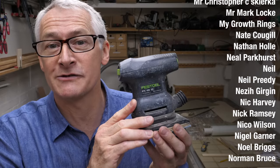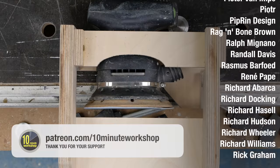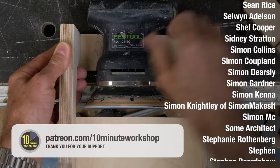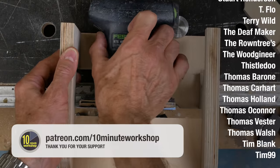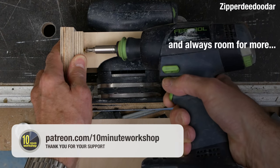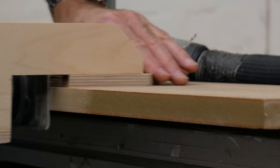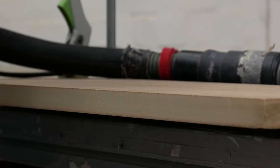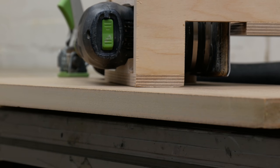There is one other reason actually: I don't use my ETS 125 for edges. Don't get me wrong, it's a great little sander, but I prefer my orbital sander — the RTS 400 — for edges. It's just as small and light as the 125, but I think the dust collection is better on an orbital than a random orbital when working on relatively thin edges. I'll definitely be making a version of this edge jig for that sander. In fact, we already have the body design from the ETS 125, and the RTS 400 is near identical — this jig made for the 125 fits the RTS 400 perfectly. That's what I'll most likely be using in future.